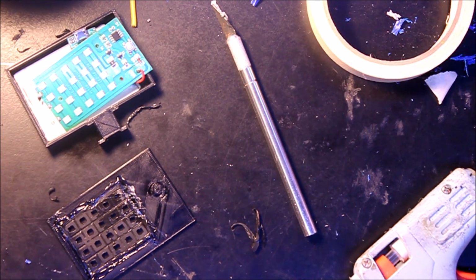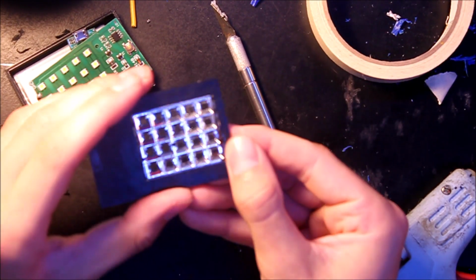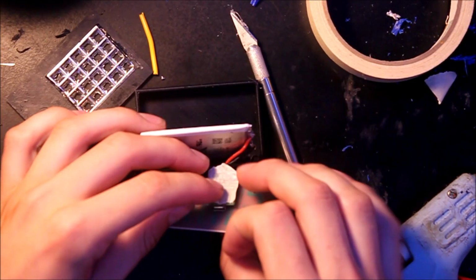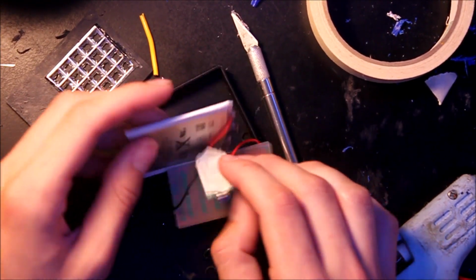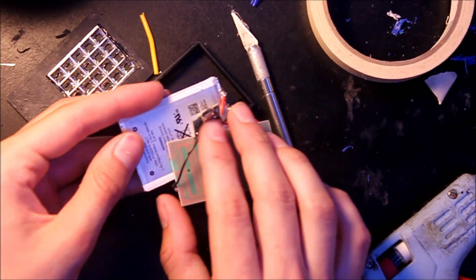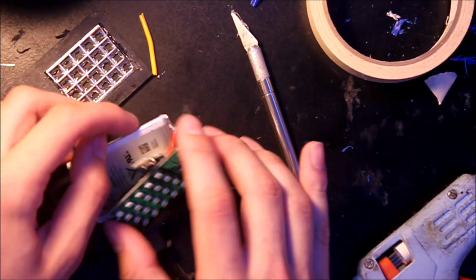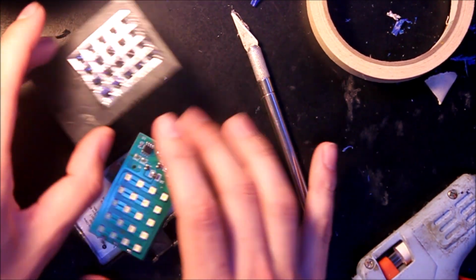So I've got the light reflector, cut it down to size and glued it into the printed faceplates. And I had to put a piece of masking tape on the back of the charge controller because, dumb me, I was trying to figure out why it wasn't working. Whenever it sandwiched against a lithium-ion battery, it was shorting itself through the battery, which is very dumb.